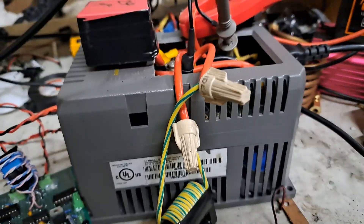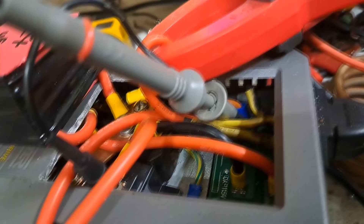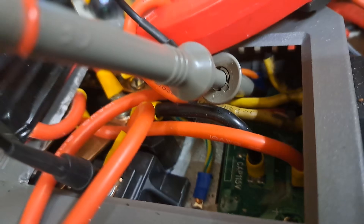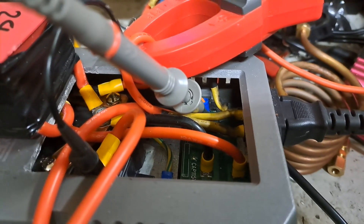Here's a half-bridge build I remade out of a super old VFD. It had a couple decent caps in there and I basically added my own brick - a 150 amp, 1400 volt brick that I found. I've got a three-phase rectifier module, and those two caps are wired as a doubler through the full bridge rectifier.